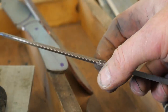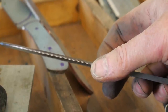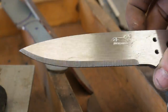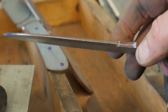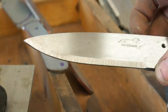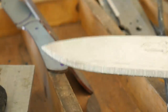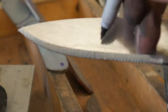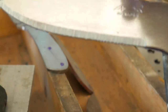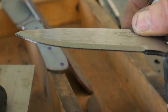This clip shows the pre-heat-treat grind. Hopefully you can see the grind there — the pre-heat-treat grind. Then you can just see the layout lines in the finger choil area. All my Rockwell measurements are made just slightly above that line after the heat treat — I'll make my Rockwell measurements around about there, maybe three or four on each blade. One after initial hardening, one after the second temper, and then the final one after the third temper, where I want my final RC hardness to be.